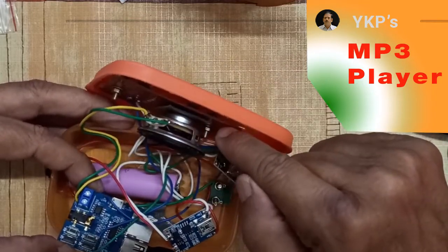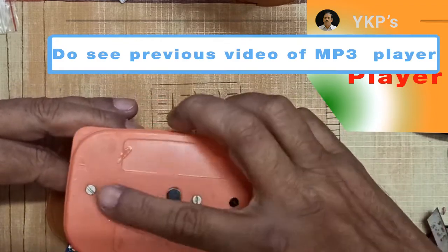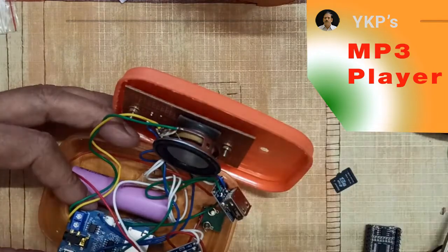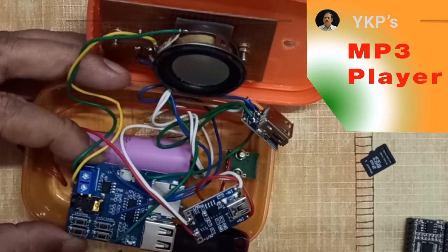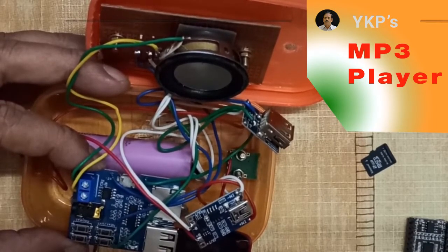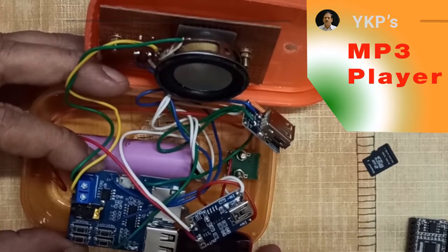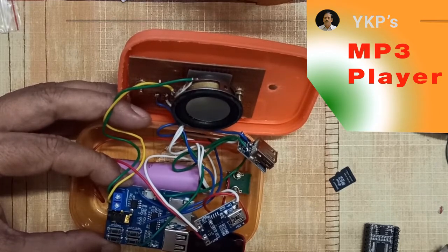This is the keys — you can see in my previous video on the MP3 player. This is the PCB which has two keys for next and previous. This is the previous key. I found out that these two are directly shorted to ground, like my earlier circuit — these two other ends of the switches, this is previous, this is next, are directly connected to ground. So I am able to take out these wires — this is previous, this is next — and I have connected them to my PCB where I have my switches for previous and next operation. That is all I need.